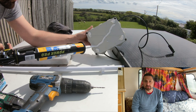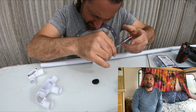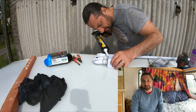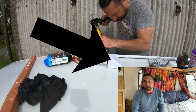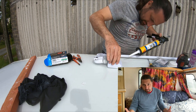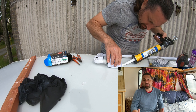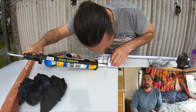I bought the biggest junction box I could find in the Toolstation catalogue and glued it to the roof. Where the cables pass through metal sheeting, particularly thin metal sheeting, there is a risk of the cable rubbing against it over time, wearing through the insulation and creating an electrical short — to prevent this I used rubber grommets. I am still annoyed at how I installed the next bit. The solar panel came in kit form which included a roof entry gland. Rather than buying another roof entry gland compatible with the 20mm conduit I decided to cobble the two together. Worse still, I orientated the entry holes to the front of the caravan meaning that they would be exposed to water being driven in whilst driving, and because the two were never designed to be fitted together I had to cobble in a T-piece and corner to make the entry holes match up. Ultimately it was a right faff and the end result wasn't as clean looking as I'd hoped.